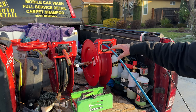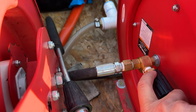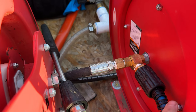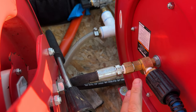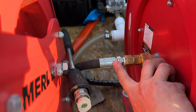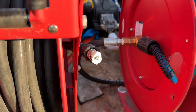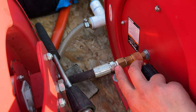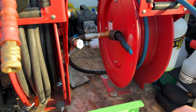Once pulled all the way out, it's ready to receive a return of 50 feet of hose — that's the most important step. This fitting right here is going to be replaced. You take off the original hose and connect into here. You may have to heat it up because it has red thread lock. You're going to put this fitting on here — everything's linked in the description. That fitting allows you to receive a male pressure washer whip that goes to your pressure washer. You only need three parts: the first fitting, the second fitting, and the whip. Once all those are hooked up on the side, you can connect your hose.